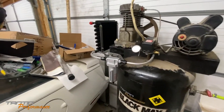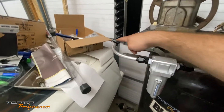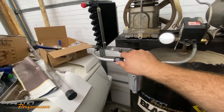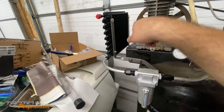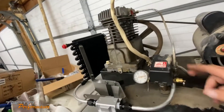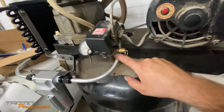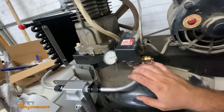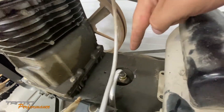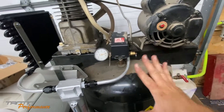This is what we've got so far. I made this bracket - I couldn't make that bend to get the cooler closer so I built this bracket. This is the factory line that went up here - I just re-bent it using spring tube benders, which worked really good. There's plenty of room underneath. I didn't want to mess with the fitting in here because that has the check valve for the tank.